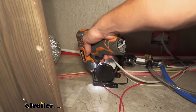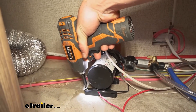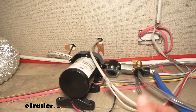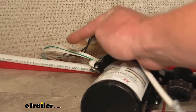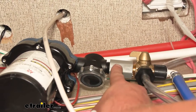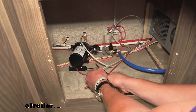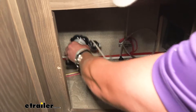It's a little tough to see in there — it's kind of a small space. I'm going to go ahead and just take this thing off the ground; there are just four different screws, which will make it easier to access all the different hoses. It is extremely tight in here, but basically what I'm going to do is loosen this little white 90-degree fitting — there's just a little nut on there. Then on this side I'm going to loosen this because our new pump does come with this piece. Then of course cut the wires — super, super tight, so I need two hands in there. Once all the connections are cut and the wires are disconnected, this whole thing should come right out.